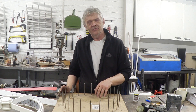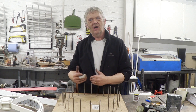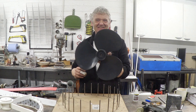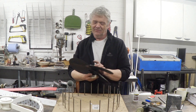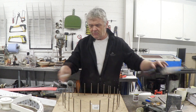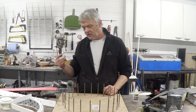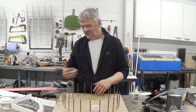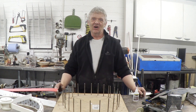When I talked about the plan, I was thinking of adding a fan in the center of the rotor to help with air movement. I came across this desktop fan which I thought was pretty awesome, and it nearly fits in the center, which I thought was even more awesome. So I've taken my jig, measured the thickness of the stator, then measured a gap of about two millimeters, then the magnet and the thickness of the material — and it fits.